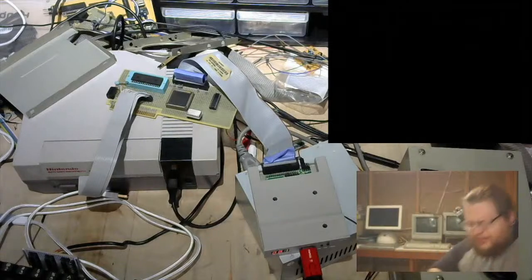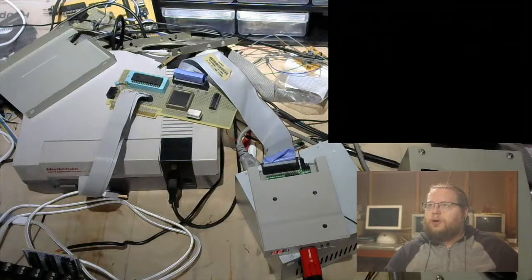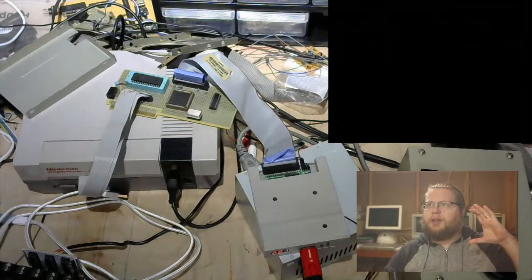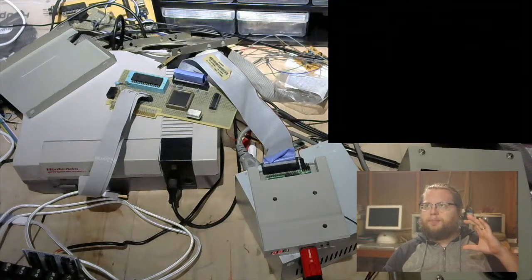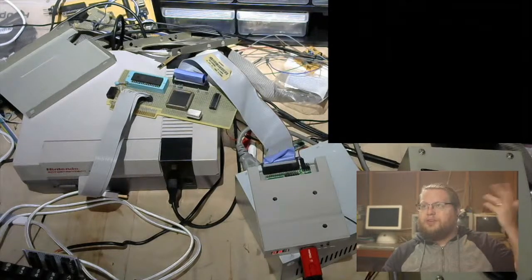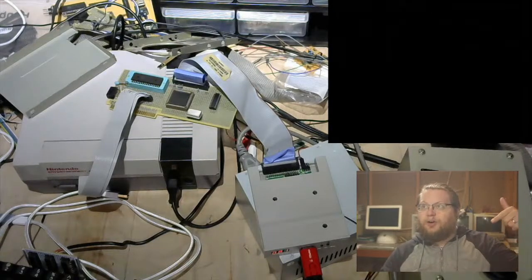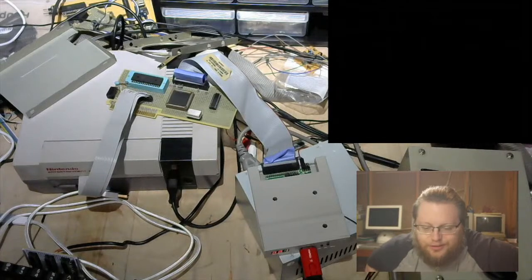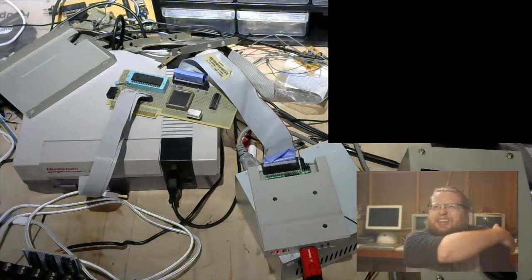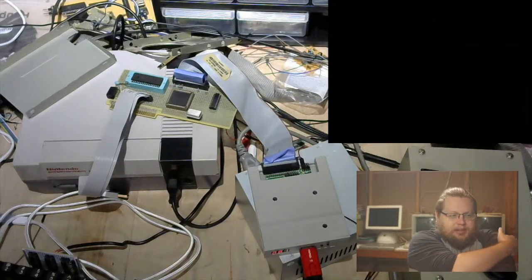Anyway, I'm pretty sure it's clever enough that it uses the return value from the stack. I think you literally put the command block right after the, they might use the break instruction, and they just figure out, they use the return address +1 to load the block from, and then depending on the command, it jumps back to your code just past that, which I think is super duper clever. So I probably won't be that clever, but roughly I think I'll just, like, how clever can I be?